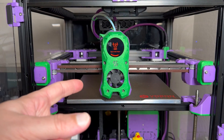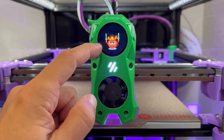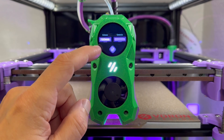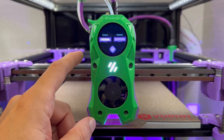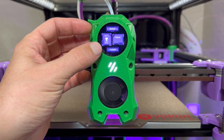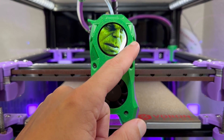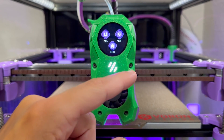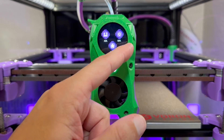We're going to do a first boot sequence. Printer started. Let's take a look at the touch functionality and how it feels on the Knomi 2. I have changed the default settings and reduced the amount of options for retraction — I never go above 100 millimeters and never extrude less than 50 millimeters from the interface. I never go faster than 5 millimeters per second or slower than 3 millimeters per second on extrusion. Regarding the temperature, it seems to allow negative values — why do we need negative? Just remove that. We also have the opportunity to pick ABL Home and Quad Gantry Level, but Quad Gantry Level doesn't work for me — I have Z-Tilt on my Voron Trident. I don't know why we don't have an opportunity to change this option in the web interface — BigTreeTech, take a look at that.